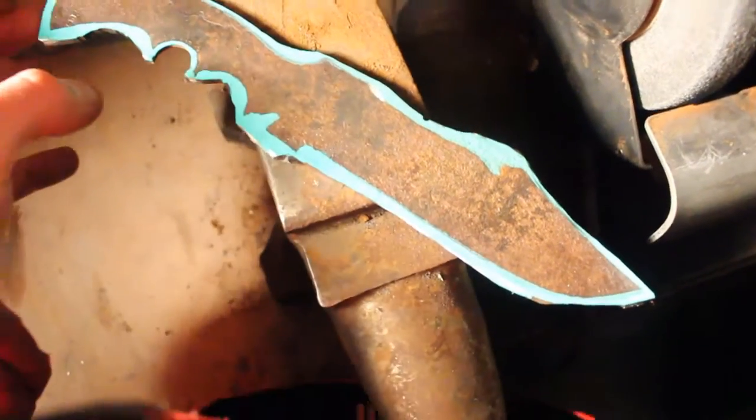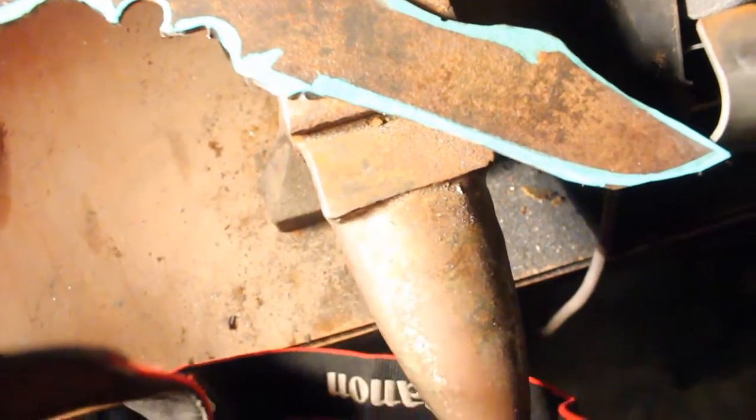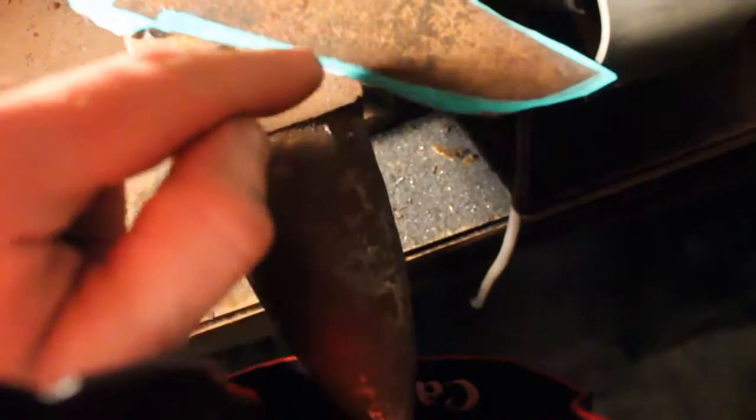I cut out as much as I could with a hacksaw, more with the angle grinder and the rest with anything else. At this stage the metal was still hardened, as the shed I store the forge in was jammed shut after a storm. I created a rough shape and retraced the template and blade grind onto the metal with a chalk marker.